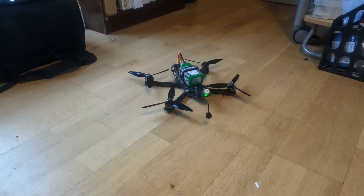The next thing I'm going to check is that the copter moves in the right direction with a little bit of throttle. So I'm going to try pitch up, then forward, then roll left and roll right — just with enough throttle to give me a bit of lift. While the copter's still on the ground, this allows me to make sure it's working in the right direction.